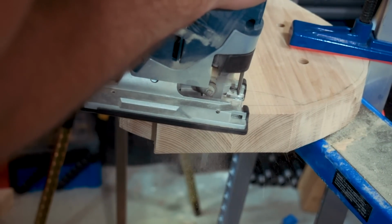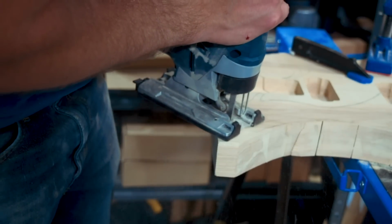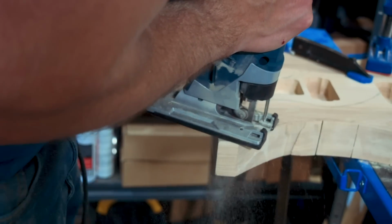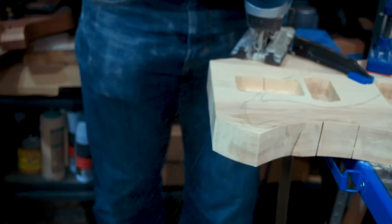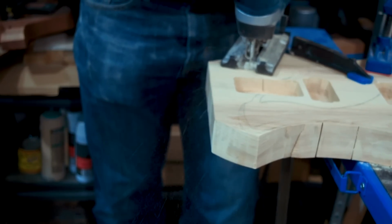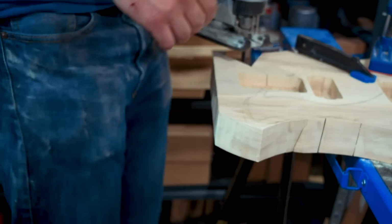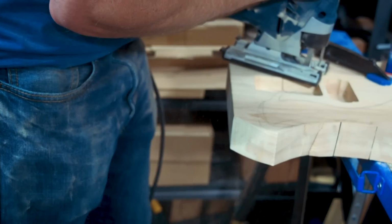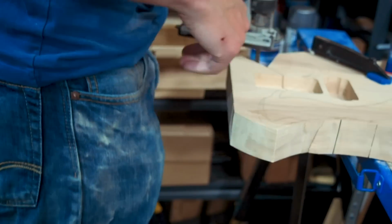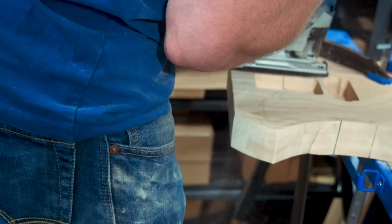The top horn there, and let me be clear, it's because I'm bad at acoustic, but that top horn there can extend as far as it needs to. Really, it could go on for another 2 feet and it wouldn't really matter as long as you've got hand access on the other side. The top horn, as long as there's a carve there for your stomach and rib cage to go into, it doesn't really matter if it's pointy or what direction it's facing or anything like that. So there are some pretty aggressive guitar designs out there that have that going off on a weird angle and it's sharp and all of that, and they're comfortable to play. I've tried a couple of them because that section doesn't really matter.